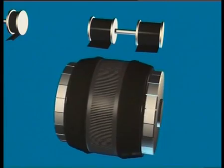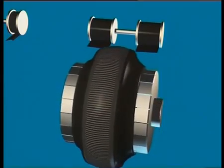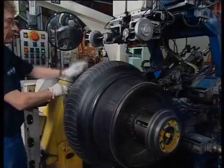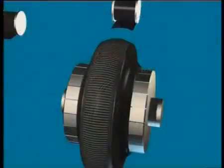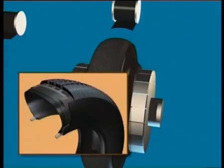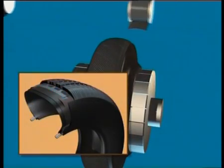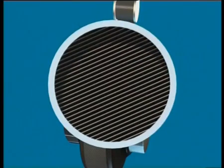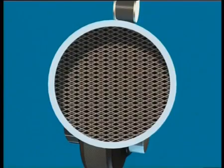The tyre is then shaped by inflating the central section of the drum. Two plies are applied to the crown of the tyre. They are reinforced with metal wire arranged obliquely and, with the casing ply, form a network of triangles to limit the deformations of the tyre.